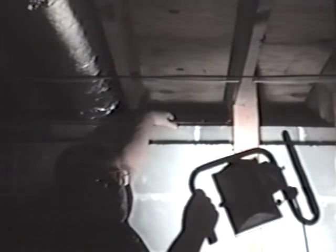Up here where you have your cap that goes over the concrete, remember we said we were looking for sawdust and also for the rotted wood. But see this part right here, this has holes in it, whereas this part is closed off. So you'd be less apt to get termites coming up through this open part, but they would climb up this concrete wall part here and get into that.